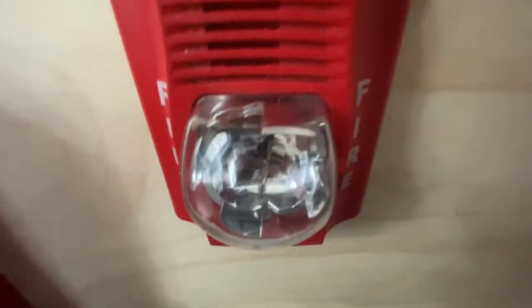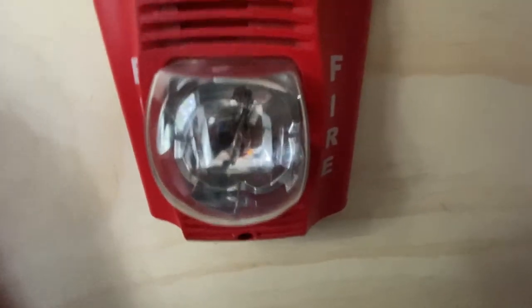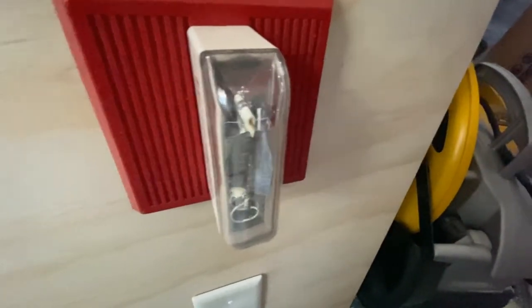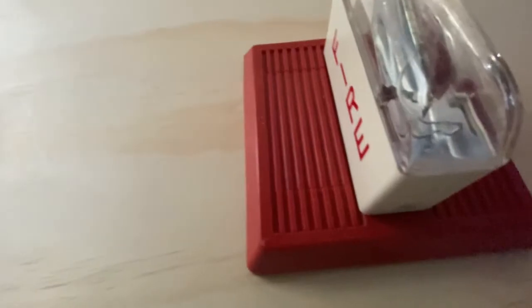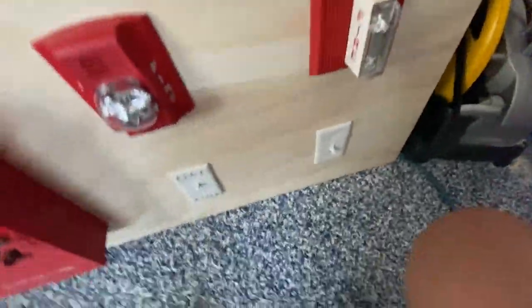This is the two. I have it on 2-wire because I just figured out how to do 4-wire, and we haven't done that yet. So hopefully in the next system test, when I get more devices and stuff, this will be 4-wire. But to continue, my Wheelock MT-24S SLM. This is an SLM, which means it's syncable, and it's set on fixed 1575 candela. Also on high volume temporal. Give me a sec to turn on the lights. You can see a little bit better.